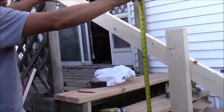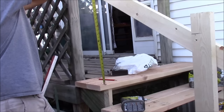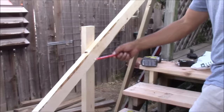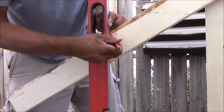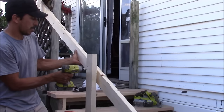I'm going to use one screw at the bottom to secure it. Then use a tape measure and measure from the very front of the step in two different locations to make sure the board is the exact same height in both places — this ensures we match the angle of the steps perfectly. Now we can secure the 2x4 to the outside of the top vertical post with one screw, and make a mark where I'm going to cut the bottom post, and a mark where I'll cut the top railing.